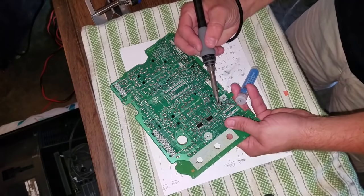Welcome back — I had to show you this. This was the very last capacitor I removed, this very large one, and it was shot — it was leaking. Look at the nasty spot it left on the board. I checked after every capacitor I replaced, and that was the only bad one. It was on the deflection side, so that would affect geometry. I'll have to clean that off, but now I'm going to finish up with the last capacitor replacement.